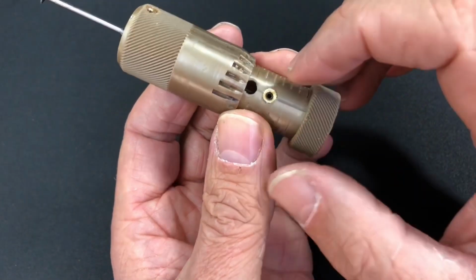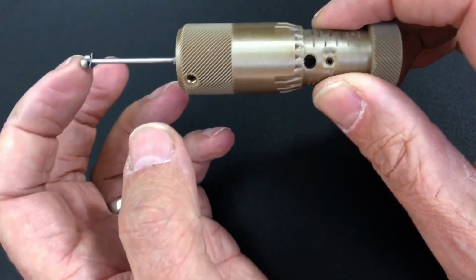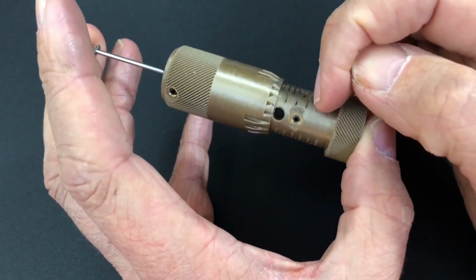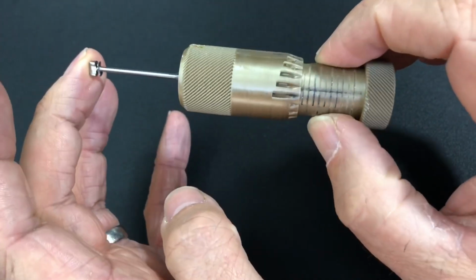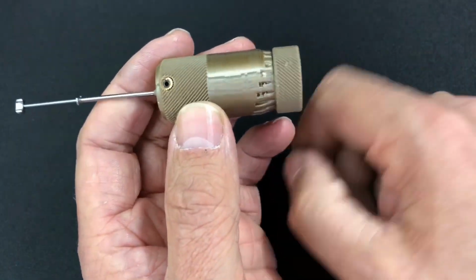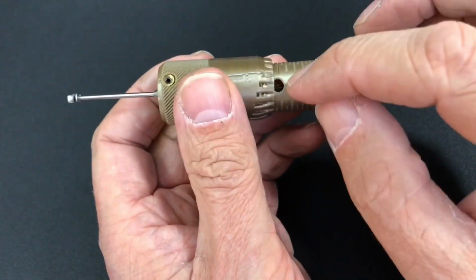Make sure all the plastic has been removed from inside of this chamber here, and then obviously your tension tip will go in smoothly. There's a little hole just at the back end of this where it inserts into this, and then obviously you can tension it up equally and get yourself a nice slidey sort of finish there. So just make sure that all the actual plastic's removed, make sure it's tight.